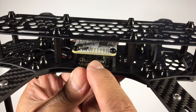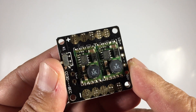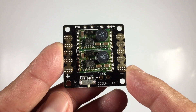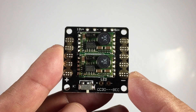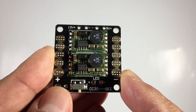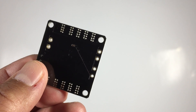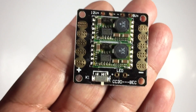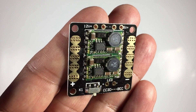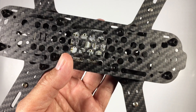I've got a PDB in there - it's designed to run 3S and 4S, so we'll be able to run both types of batteries. Let me quickly show you the PDB I'm using - I picked this up from Banggood. It will allow me to run 3S and also 4S, so depending on the application, we'll be able to use our 3S batteries along with 4S. It supplies 5 volts and 12 volts, which simplifies running UBECs, managing LEDs, and providing 12 volts to LEDs and the right voltage to the FPV gear. I'll have a link in the description for the PDB board.